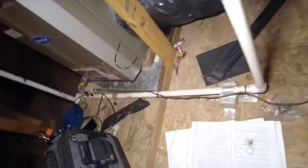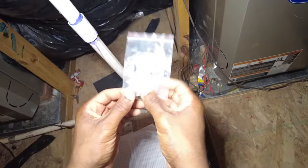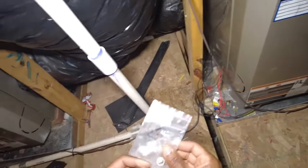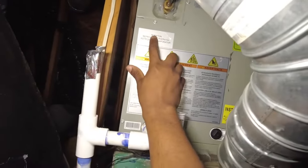Alright, so we're up at the air handler now, and this is how the kits come. They've got various different sizes and the sleeve here. I've been on units before that just weren't cooling right, really low temp splits, and I've seen where they just put these pistons in without the sleeve itself. And sometimes they don't size them right. See, they've got different sizes. That's 063. It'll show you the piston size here, 058. Let's go ahead and crack it open and see what we get here.